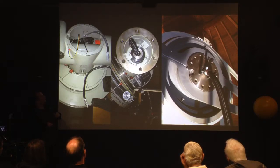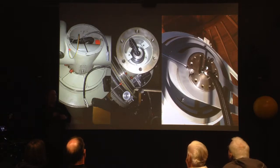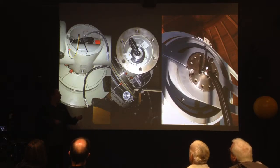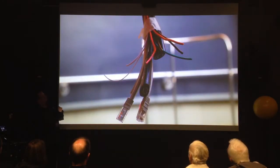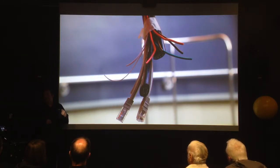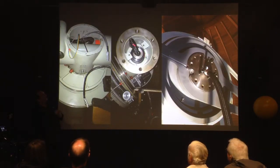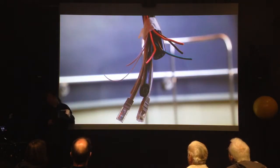The next step once that was on was actually putting the wiring back. Tony and I spent a day down in the Matariki room with about five tables lined up. We decided the telescope needed to have USB, network, and power running all the way through it so cameras could be at the back. We made a huge cable harness and put it through the original cable path — up the middle of the telescope, doing a U-turn and coming back. We originally planned to use hard conduit but that wasn't going to fit, so we ended up using flexible sleeving.